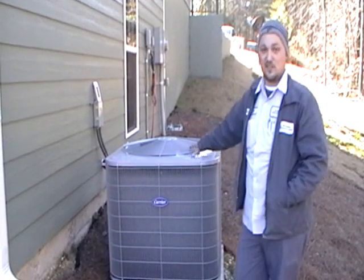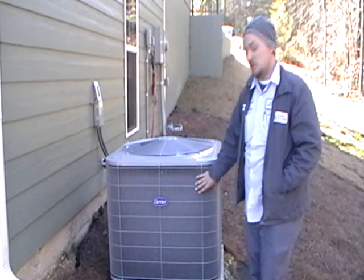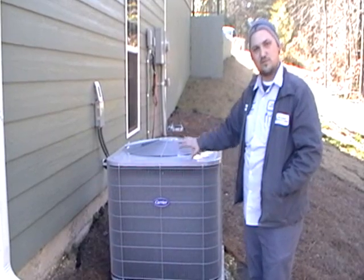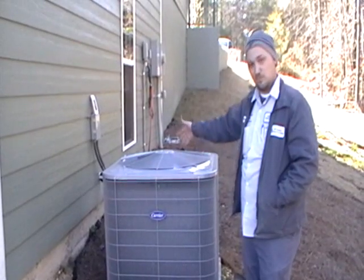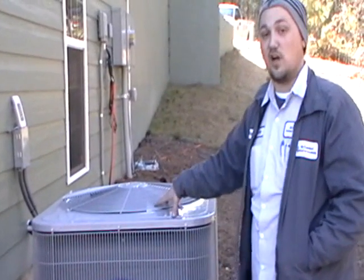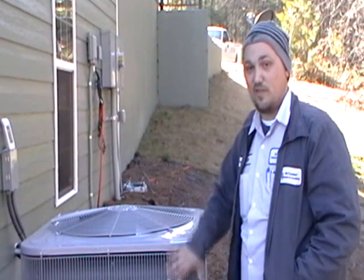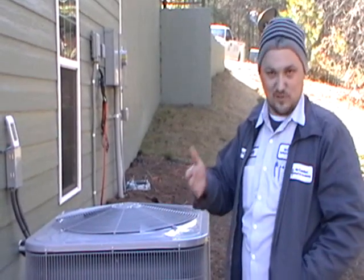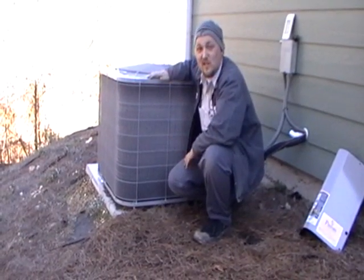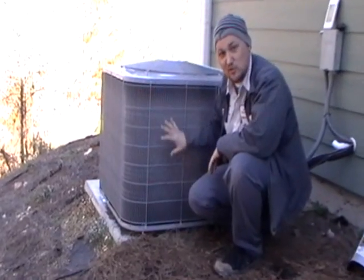In the wintertime, that same humidity will be pulled out of the air. It just comes in the form of frost on the outdoor coil, which is the cold coil in the winter season. The reason it's cold out here is because we're trying to pull heat out of the air — that's where the heating comes from with your heat pump system. So if you see frost on the outdoor coil, that is not a sign of any kind of failure or malfunction. It's something that is natural to the process by which it is heating. And the colder it is, the more humid it is, the more frequently you will see it. We're starting to see some frost develop on the outdoor coil — again, natural process of the heating process, just condensation showing up on the coil in the form of frost.